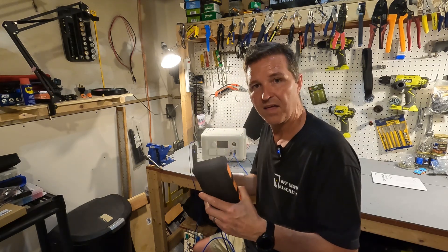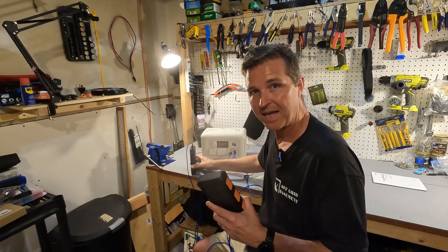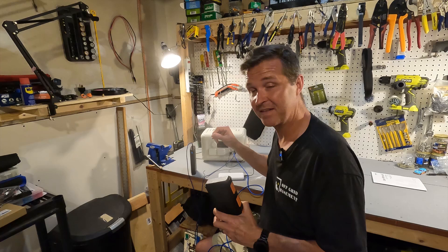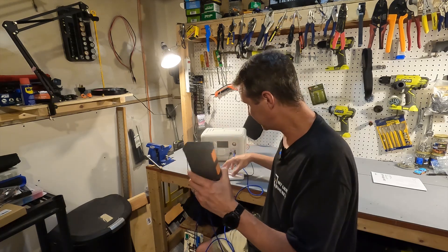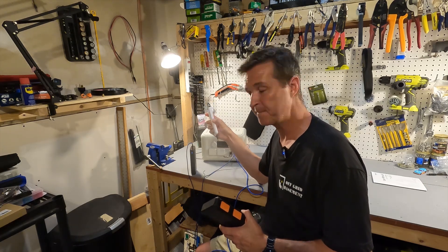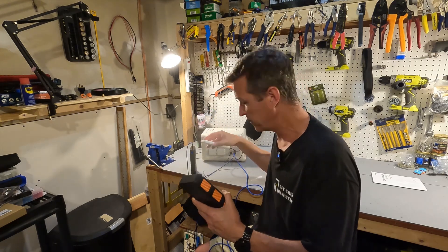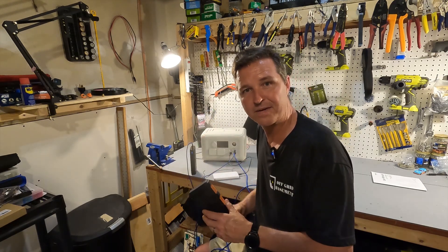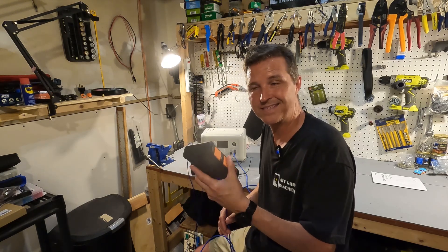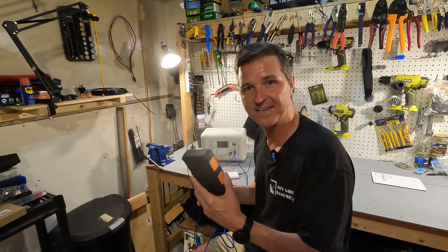In full disclosure, they are not brand new. This Belkin over here is a 20,000 milliamp and it is probably four years old, so battery degradation is going to have a big part to do with this one. But this Good Ah and this 15,000 milliamp right here, these are only about a year old, so they should have minimal battery degradation. Let's just say this is 169 watt hours, take 10% off, and let's put it on my tester to find out the real capacity.